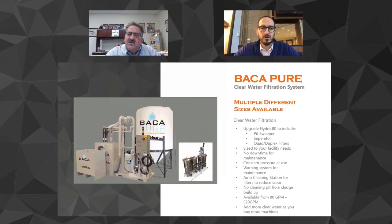What happens with the coagulant, what we use, it pretty much keeps the pH neutral and it tramps out with the solids. So it is user-friendly and it goes out with the sludge. It has a half-life, so it's not like you're going to accumulate a drum of this coagulant in the bottom of the filtration system. The coagulant leaches out with the solids as you change your hopper bags and change your filters. Was that clear?